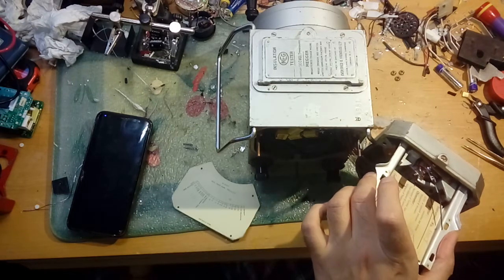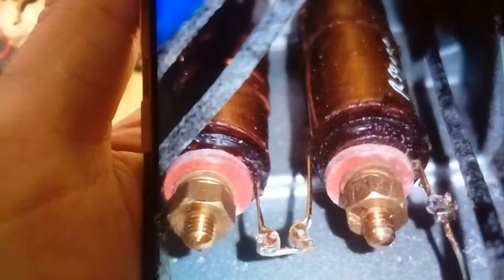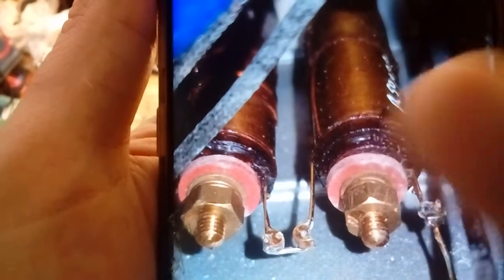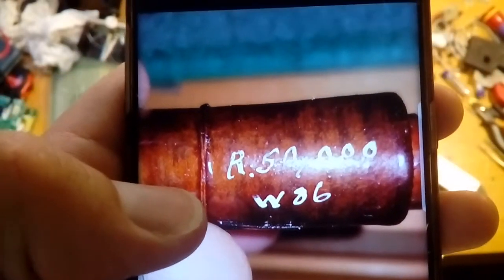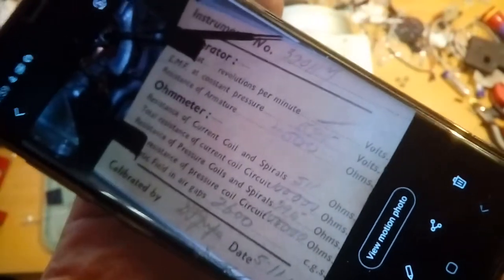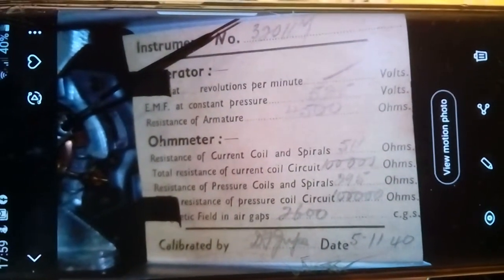Let me give you a good view of the inside. Down at the bottom are the resistors - here's a close-up I took where you can see the 50,000 ohm wire-wounds, each being 50k and surprisingly accurate on the singular one that still worked. Here's another shot showing the fine winding - the value marking, I'm guessing 'W' means something like six watts. Then we've got the actual calibration sheet that you can actually see.